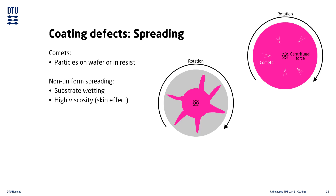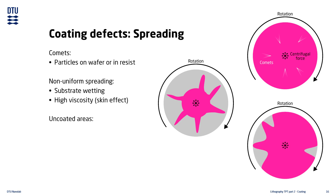The third type of spreading defect is when there are smaller uncoated areas. This could be caused by having a dispense volume which is too small. In the automatic coaters the dispense volume is controlled by the tool and will rarely be a problem, but in the manual spin coaters it is the user who controls the dispense volume — a rule of thumb is one milliliter per inch of substrate diameter. This defect could also be caused by an off-center dispense, which can sometimes occur in both automatic and manual spin coaters.